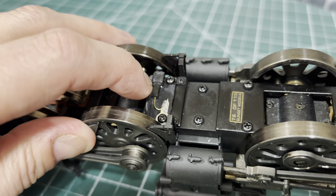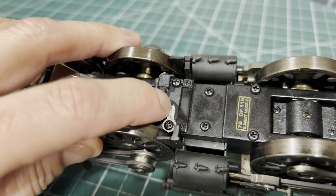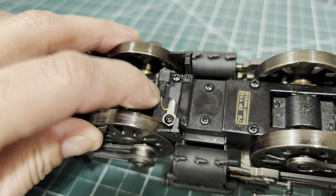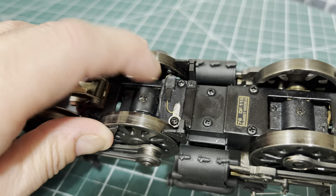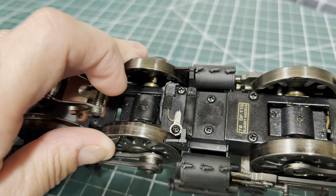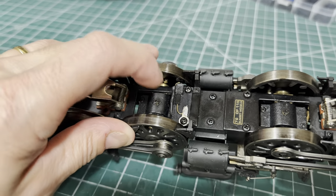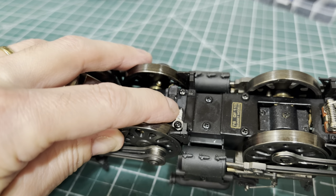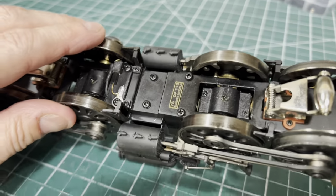Depending on what boards you use, if you run the chuff directly to the electric railroad cruise commander, it's a grounded input. I have to be careful if you're using some of their standalone sound boards, like their rail sounds commander or sound commander or whatever they call it. It's kind of a floated input, so you'd have to run both of these wires back to it. So this wouldn't work for everything, but...